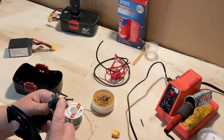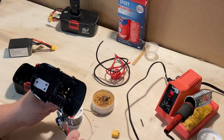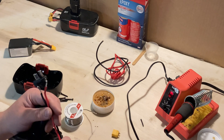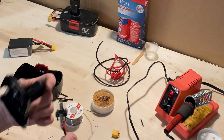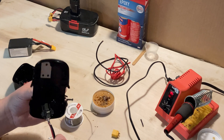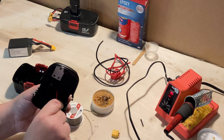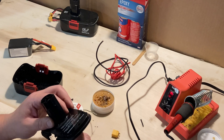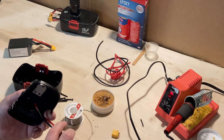We're going to use some two-part epoxy. I typically sand the outer part of this a little bit and sand inside here so the epoxy holds well. When mixing the epoxy and adding it to this connector, be really certain you don't get any epoxy on the connections. I just put a little bit on the sides and a little bit in here — very little — and feed it straight in without moving it around, so it doesn't pick up epoxy on the connector walls.